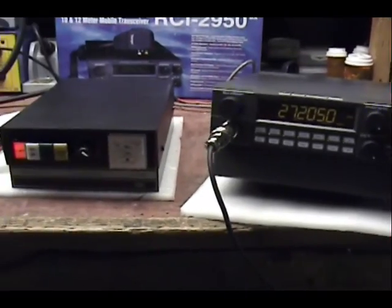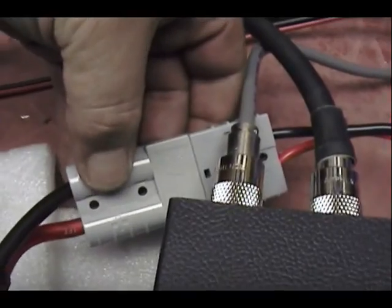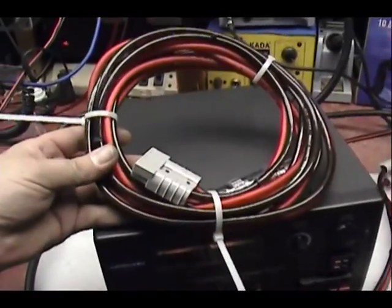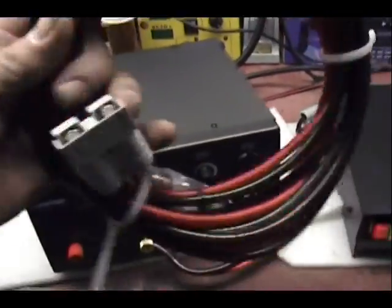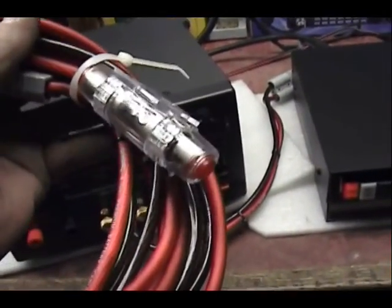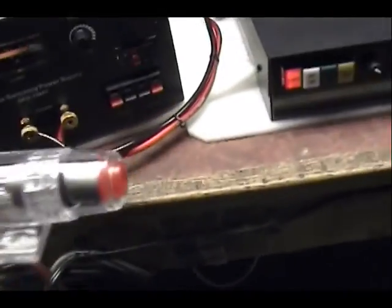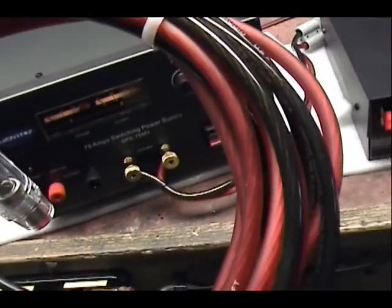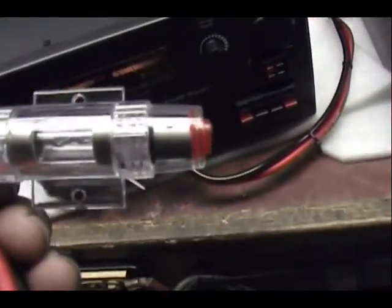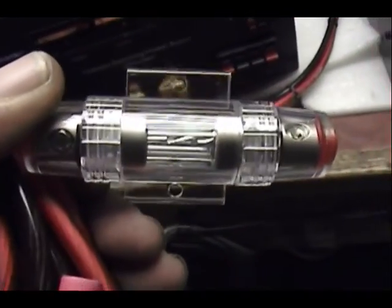So Robert, you asked me to hook all this up for you. I made up all the cables like you asked. It now has a quick disconnect on the amplifier, a quick disconnect going into the power supply, and I made you a power cord for your truck that has a quick disconnect and a fuse holder. I left the fuse holder disconnected, so route the power wire from the inside out, cut off any excess you don't use at the battery side, and then put this fuse holder in over where the battery is.